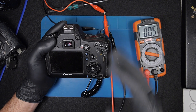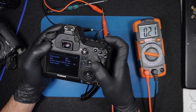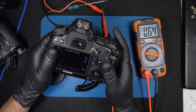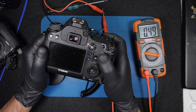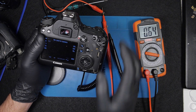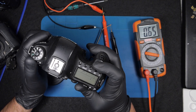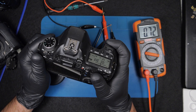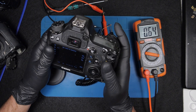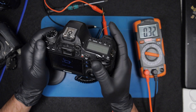To show you a few more examples: turning on the screen gives about 200 milliamps. Switching to live view jumps up to around 640 milliamps. Taking pictures increases it further. The reading changes based on what the camera needs at any moment, then returns to standby. This is the normal way the current reading behaves, but what I really want you to understand is the startup sequence.